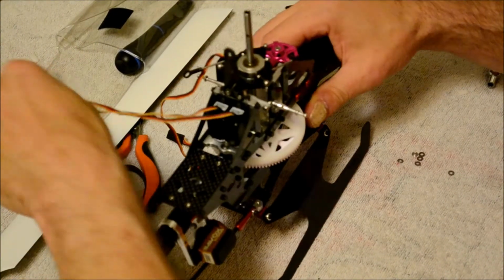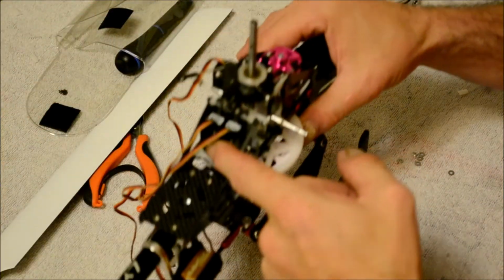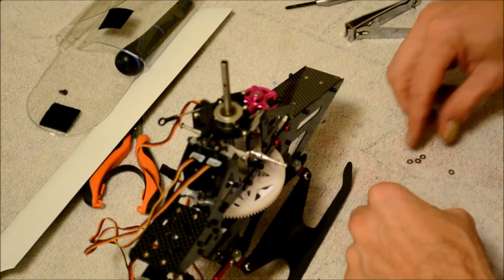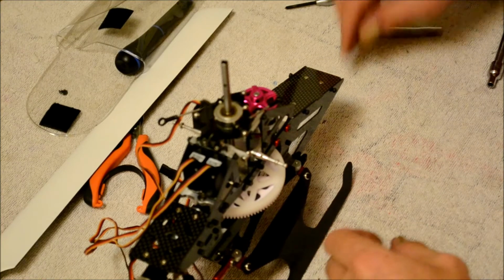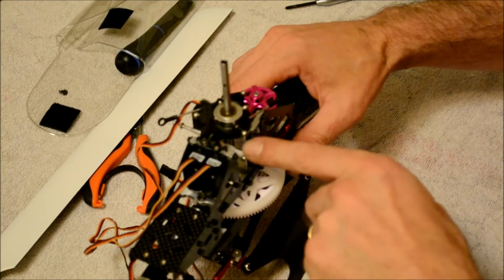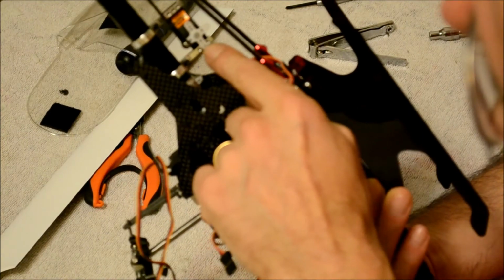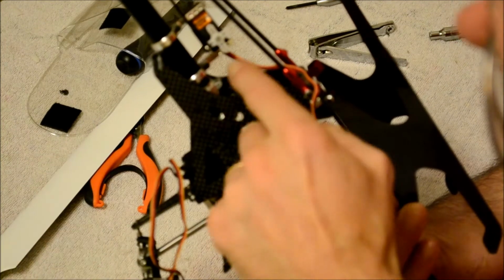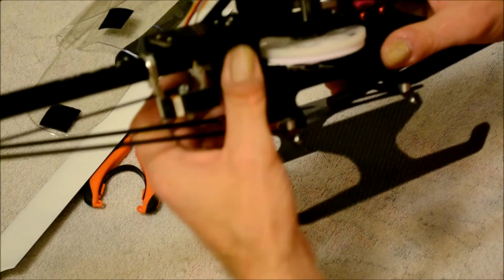I have my servos mounted. They're 3020s, the same exact servo as the H3020. They mounted in. I did have to take the little washers off. The flange didn't fit. The A3020s have a hole in the slot for the flange. I made my own servo arms. They're actually tail servo T's like that, and the hole all the way to the outside, I just opened it up a little bit so I didn't spread it, and then I trimmed the 3 other tabs off, and that's what I'm using in here.